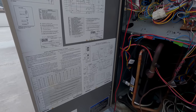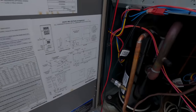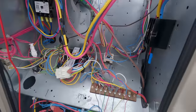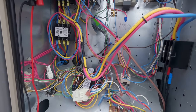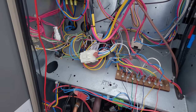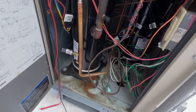I may have to grab one of my other books because I don't think this one has much schematic-wise for what I need. That's kind of what we've got going on here. I'm going to put a thermostat on there so it breaks Y2 whenever it gets below 45 or 50 degrees or something like that. The economizer should be more than adequate. But I don't want to wipe out Y2 completely because then it won't run in the summertime — that's why we've got to use some sort of stat to do that.